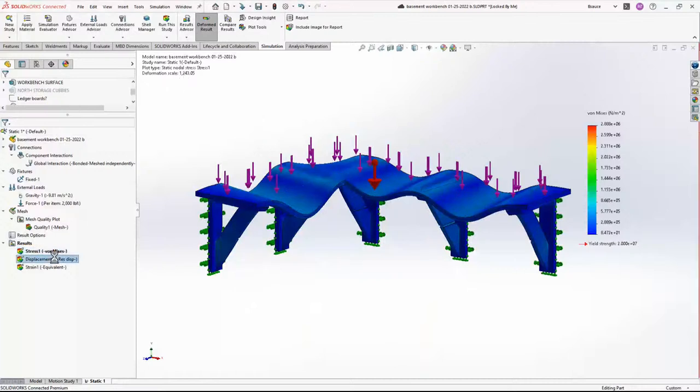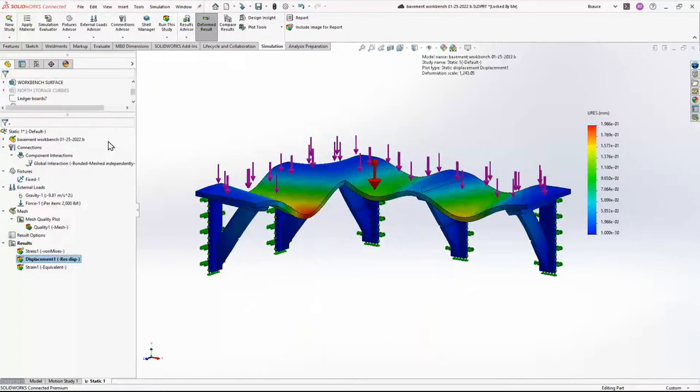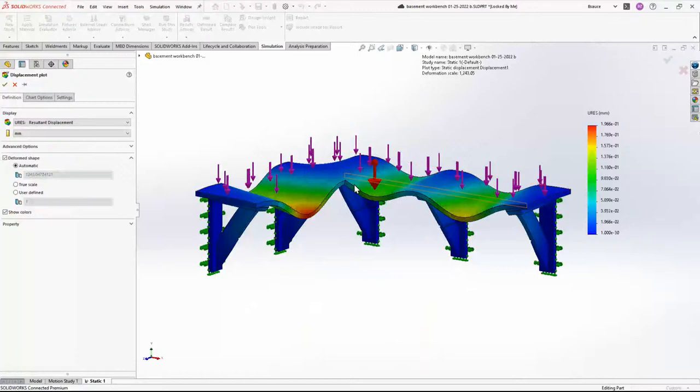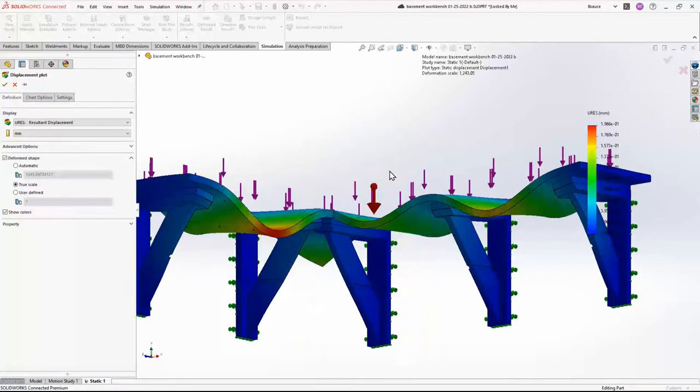Okay, so the first thing when you look at sim, deformation scale is 1200. That's a scaling issue there, right? Yeah, let's look at displacement. And one of the things I like to do, especially on a demo or a consult, let's just go ahead and make this a true scale deflection. Although it's good to see this because it's your gut check. Hey, is everything glued? Is this what you would expect? Magnified 1,000 times to see, you know, kind of the interstitial pieces here deflect.